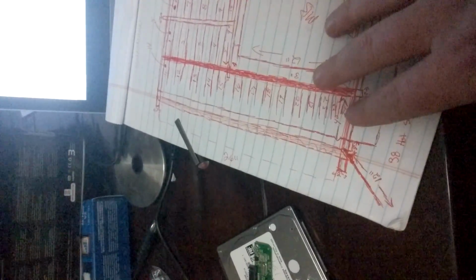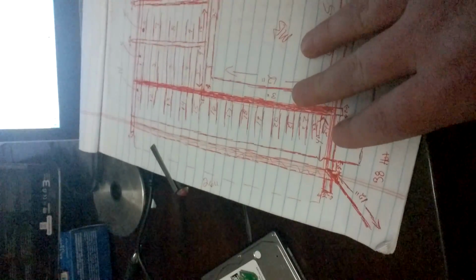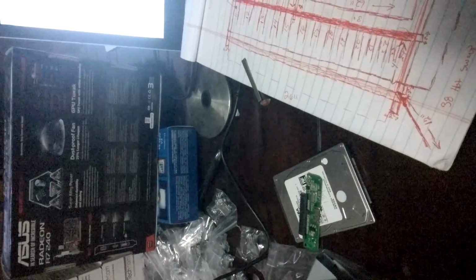Of course, in order for this to actually work, we have to use Windows 8 or above because they use storage spaces, which will allow us to cluster this all into one piece without using RAID. So this is going to be one giant array, somewhere around 16 terabytes. I'm not sure how much we lose with parity just yet, but we're going to be somewhere around 16 terabytes.